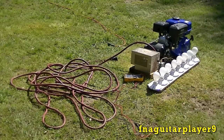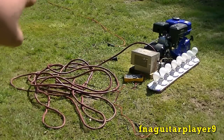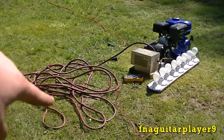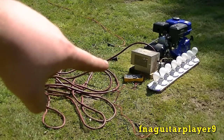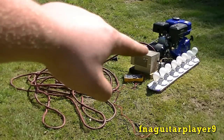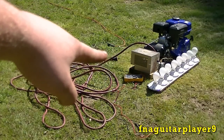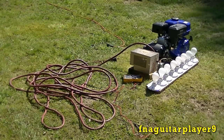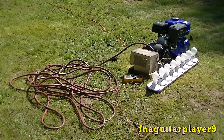Okay, now all we got here — see this orange wire coming up here? That's power coming straight out of my garage, plugged into 120, and I got my generator cord here plugged into the outlet. It runs over to another plug. Now if you make a cord like this, you've got to be extremely careful because if you plug this into hot power, the plug's going to be hot, and you just touch it and you're going to get shocked. And if you have an actual generator, it's best to have it hardwired directly to a circuit breaker back feeding into a panel.